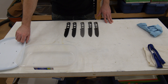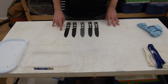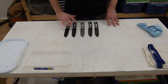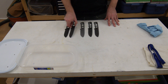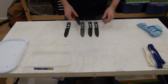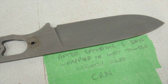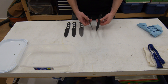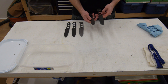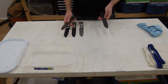These test blades were sitting in the container wrapped in wet towels for six days, and there's been a variety of different reactions. The Cerakote performed the best with no rust marks — nothing at all. The DLC has one tiny mark; other than that it's completely untouched, which is actually pretty amazing — I was not expecting that good of a result. The chromium nitride has a couple of little rust spots but overall didn't do too bad. The WCC did not do well — it's rusted through in a number of spots. The dual layer coating with the chromium nitride under layer did better, but still nowhere near as well as the DLC.